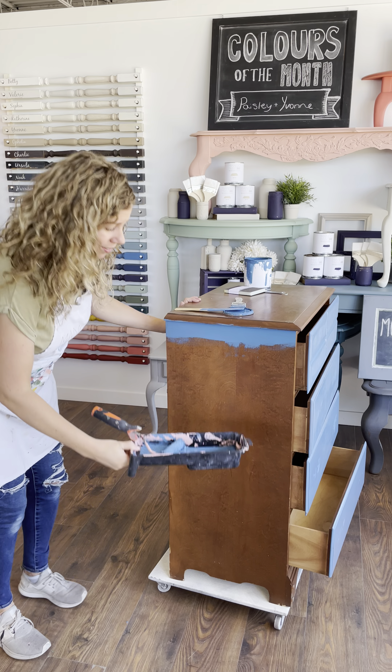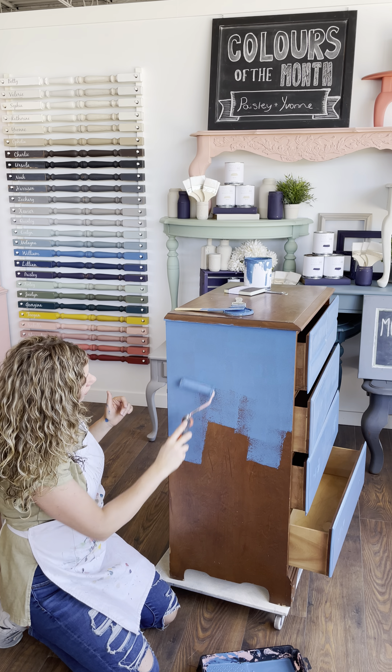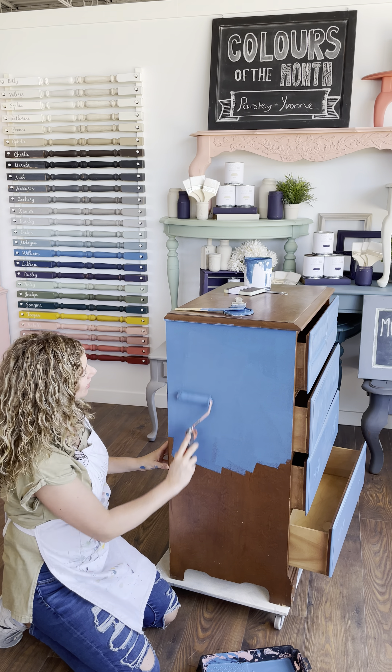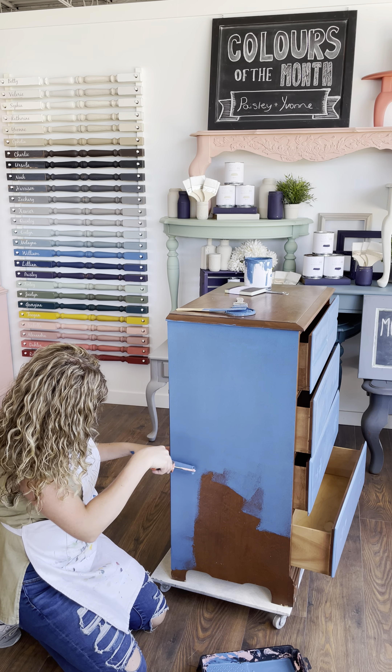I got that lip done up there with my brush and now I'm going to come back and get the rest with my roller. I'm taking my whole tray down here — work smarter, not harder. I'm offloading the excess paint and going right into the area I did with the brush. The reason for that is the brush will give you different marks than the roller, so if I'm doing it with a roller I want the whole piece to end up with the same kind of painted look. I go in all different directions and light pressure is the key — that's how you don't end up seeing directional marks when painting.